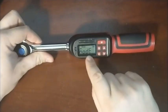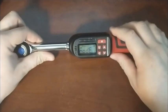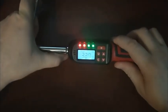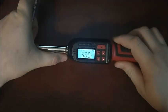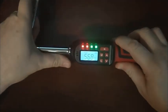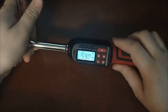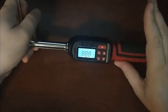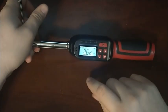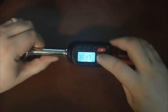It says 'node' instead of 'mode' — that's just how it is — and you can see that switching between those you can go from peak measurement to where it will go up to a preset setting. In peak mode you can see it will retain the value momentarily, but it will not refresh with a new one until it is cleared, which may be concerning if you're trying to quickly torque down a bunch of fasteners — there is the chance you would retain the previous fastener's reading. The available units include foot-pounds and kg-cm.